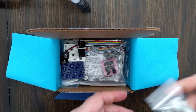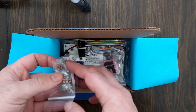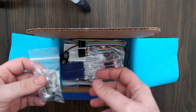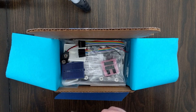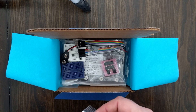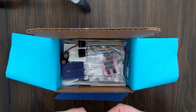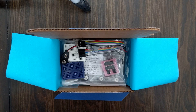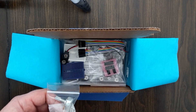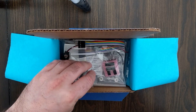And then we have three different potentiometers — there are two 500k ohms and a 10k ohm. These are useful for the tone controls and volume controls for the different things we'll do. One of the experiments we're going to have is the Atari Punk Console, also a single-step sequencer, a couple of other little sound things, some light-sensitive theremin, and a tiny organ. Just things you can try out that show what you can do once you have the output of a timer, which is just a time sequence of pulses.